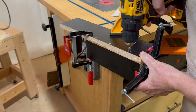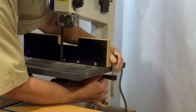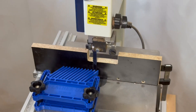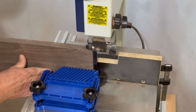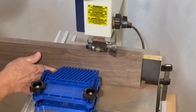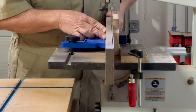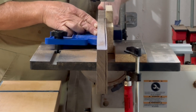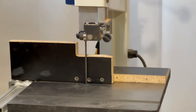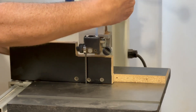Although I didn't really get it captured on camera, I was meticulous at this point to get these pieces exactly square — 90 degrees to each other. This gives me an anchor point on the outfeed end of the fence by just clamping it to the bandsaw tabletop. When I first made this fence, I made it the full length of the table, but then I realized it's really much better to end it shortly after the blade — so if you're resawing a piece of wood that has warping or internal stress released after the cut, it doesn't bind up the piece or pull it away from the saw. I also cut a notch in the fence to give some flexibility to work with different height settings on the blade guards.